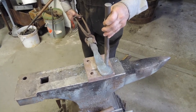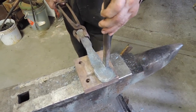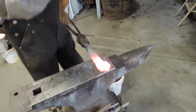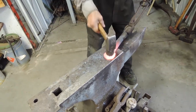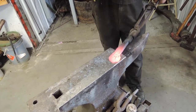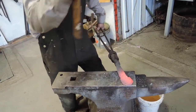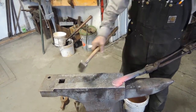What we're going to do — but we can't film — is we're going to be hitting this to make that straight edge on the end. So next time you see it, it should have a straight edge. Shape is coming. Back to the traditional hammering — hitting the outside edges so that they squeeze out so that they can be sharpened. Experienced blacksmiths know exactly where to hit, how many times, and when the steel is ready to be changed.